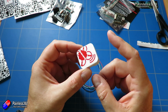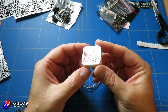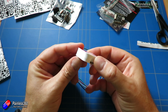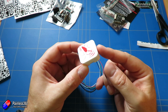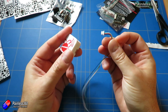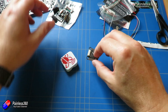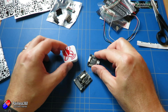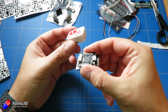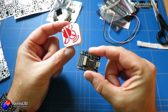The GPS has very bright LEDs that blink when it's got a lock, so it should be easy to see. It would work fine under a single layer of foam, so you could mount it internally if you didn't want to show the Brain FPV logo on top. The GPS has a large ground plane and includes filtering for the signal wires, giving you improved GPS performance. I love the fact that you can now get everything from Brain FPV for your smaller wing builds — and this is a really cute setup.